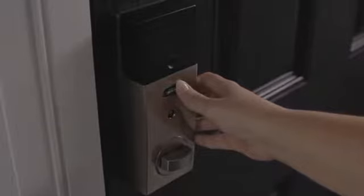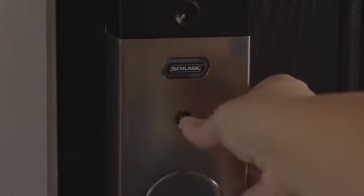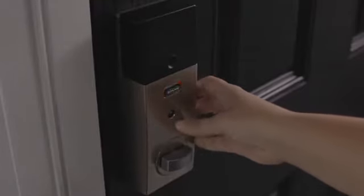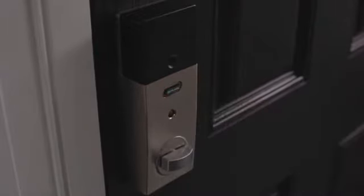With one being most sensitive and five being least sensitive. To change the sensitivity level, press and hold the Schlage button until the third flash, about ten seconds. Each time you tap the button, the alarm will beep, and the button will flash the same number of times as the setting level. Keep tapping the button until the number of flashes and beeps matches your desired sensitivity setting. The lock will beep when it leaves programming mode.